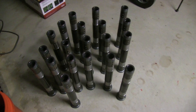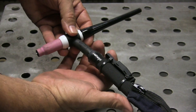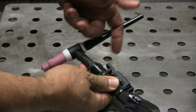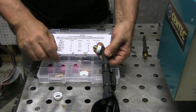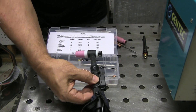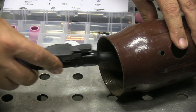I've got about 20 of these parts done, then 30 more to do with some other pieces as well. This is the torch that came with the unit — it's an air-cooled 17 set up with pretty typical hardware, number five cup, and it's got a torch switch on it that you can remove or tape back out of your way. I like the stubby kits on these 17 torches — I sell them at my online store. They really shrink the torch, make it more maneuverable, and let you get up inside things like pipe or square tubing.